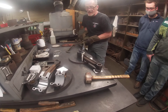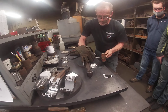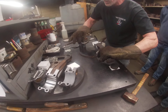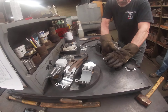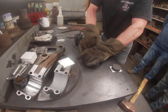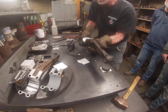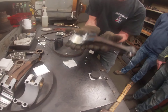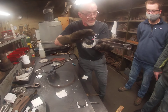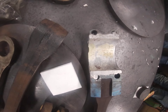For our purposes we're going to take that apart, knock the dam off, and you'll see on the inside that we have a riser on the inside as well — it's above the split line. That's why the felt's there, for the clean material. When we coat it with flat sand and put it back together to make sure it's true, that material is good in there as well. It's all about having good material.